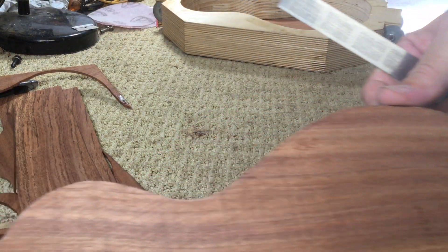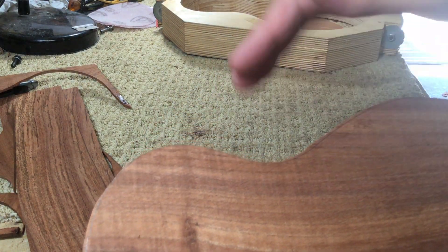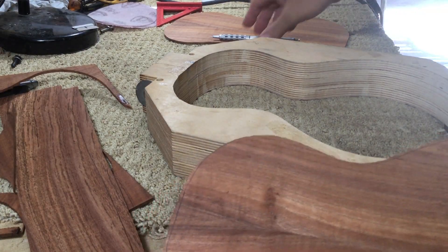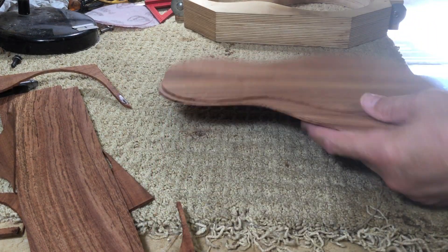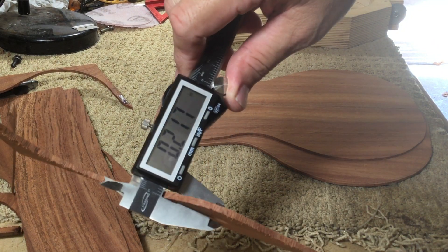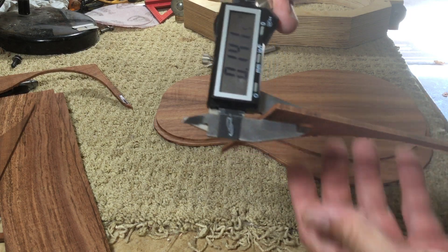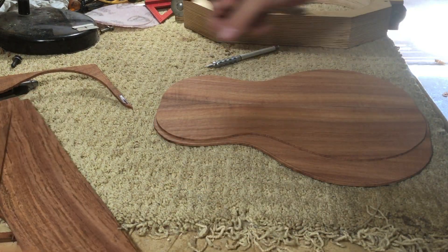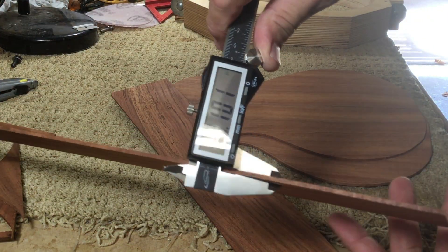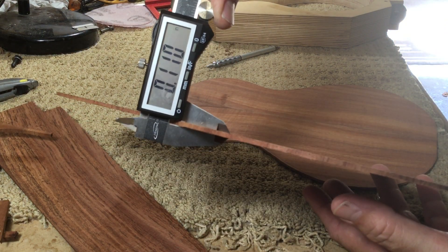I cut it really close — there's not a whole lot to cut off after that. When I first started building I left a lot of room so I had a lot of play just in case I made any mistakes, but once I got this form right it pretty much doesn't go beyond that. This one started at about 155 thousandths — I said 140 in the other video, but it's well over an eighth of an inch. We ran it through the thickness sander at 80 grit and brought it down to right about 100 to 101 thousandths.